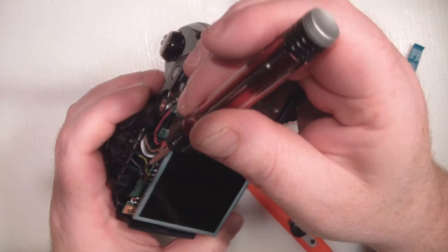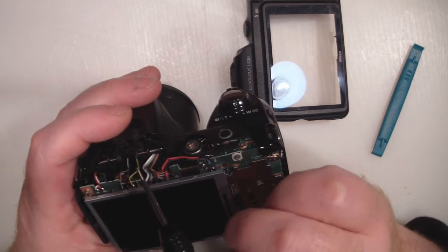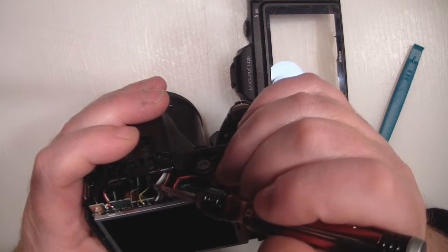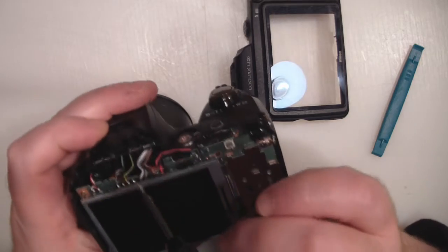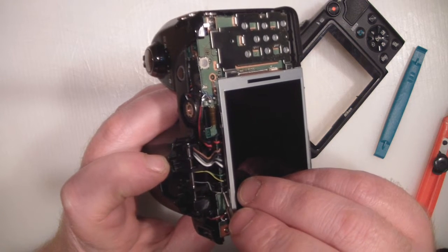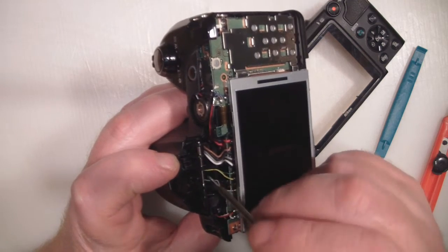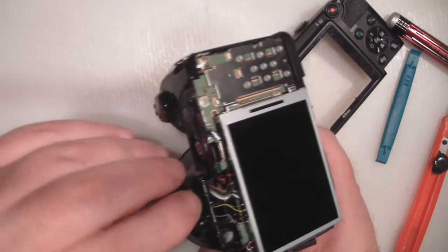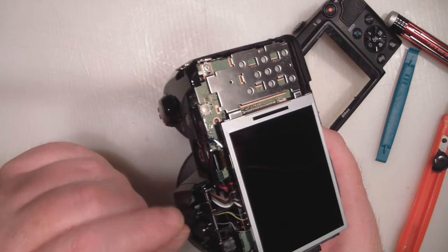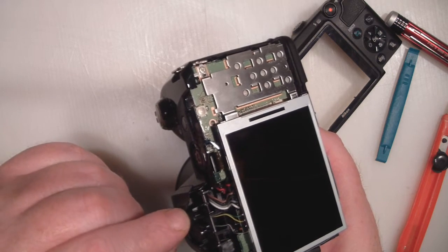Looking inside, we've got a yellow and green wire going in, and a grey wire going to the two microphones — these are stereo microphones. I would say the grey is the ground and then you've got plus for the left and plus for the right. There's actually also a black wire next to the grey that I didn't see straight away — that's separate and for the left microphone, so yellow and green are just for the right. There's not a lot of room for maneuvering, and the microphone is surrounded with rubber for shock mounting and possibly suppression from the zoom lens.